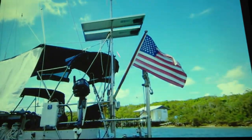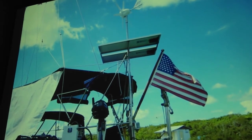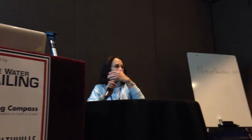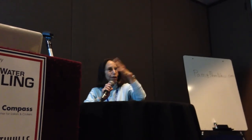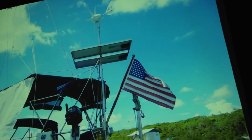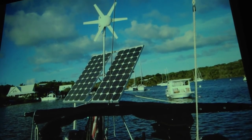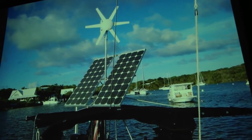We have what I call the misery post — we put this post up and those solar panels are just pipe on pipe. They will articulate this way and this way. Solar panels are most efficient when they're perpendicular to the sun. So whoever is up on deck when the sun is moving across the sky, it's their job to turn them. You can see in that picture where they're perfectly upright because they're getting the sun directly. So they're very, very efficient.